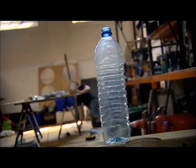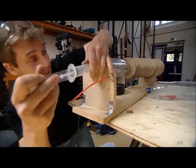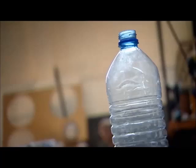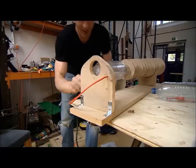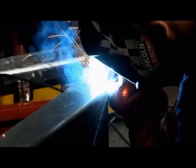That's the theory — let's put it to the test and knock over a bottle from 20 feet. I've calculated I need 125 millilitres of acetylene to produce the perfect mix. When this goes, it will produce a supersonic shockwave. The question is: can my barrel turn that into a ring-shaped vortex? Yes — pretty good! But I promised I was going to knock down a pile of bricks, so I'm going to scale up the prototype by more than 150 times.